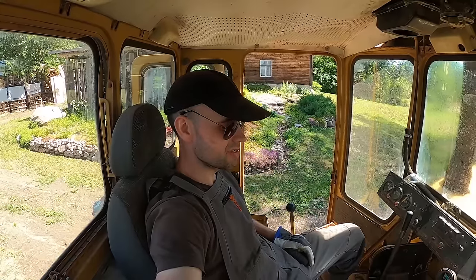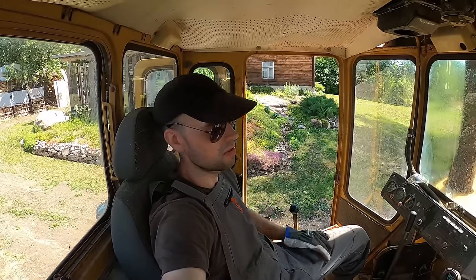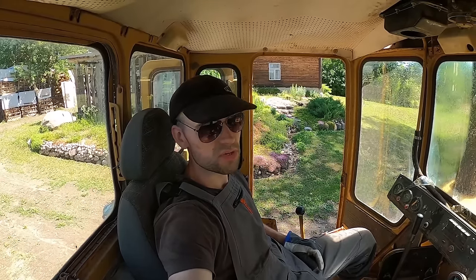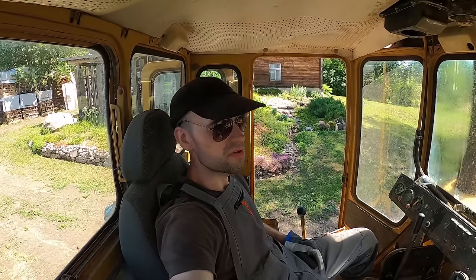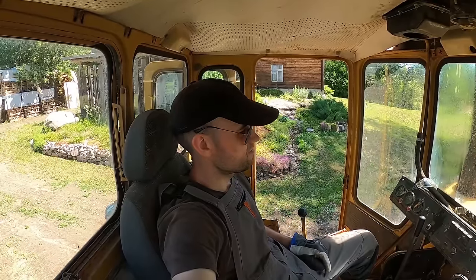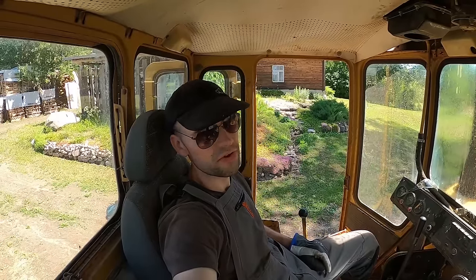Also the oil pressure, guys. Even after warming up, it was still above 3. With the old oil, it was just sitting at 1. Now it's just got to keep an eye on that oil level. If it starts to go up, then there's something leaking into the sump.